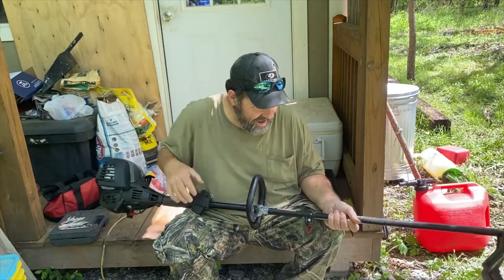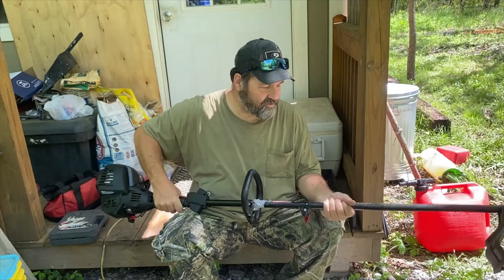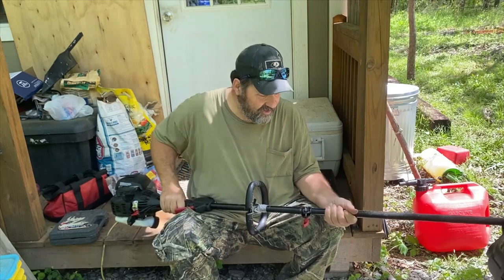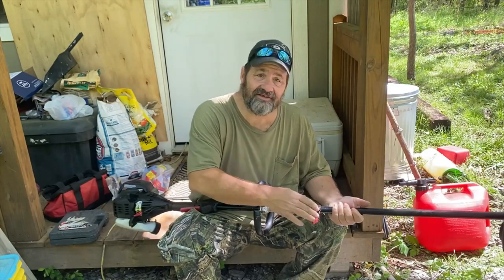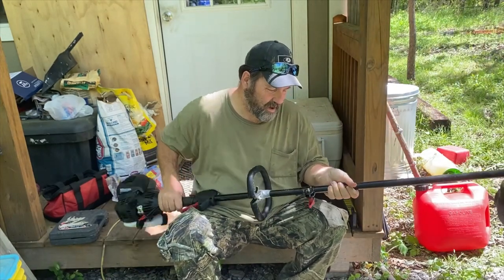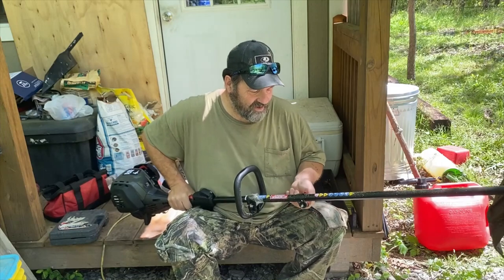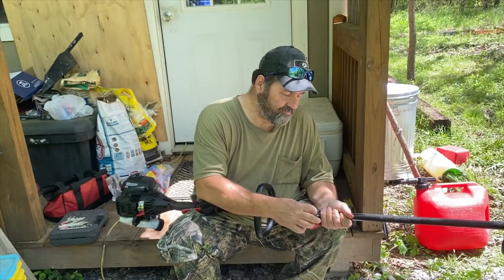And also, the torque. What I think is happening, you see this little tab, button right here, keeps it from turning, or is supposed to. But I think when I'm hitting it, it's jarring it enough to get up under here, and then the torque twists my shaft. That's irritating, and I have to come back and find that button again. There's kind of a lot of play in there, I think. I've tightened this up as tight as I dare to. This is plastic, and it looks like a quarter inch bolt, but I say that, and then here I go tightening it some more. I just didn't want to snap this piece of plastic off or strip the threads out. I imagine eventually I'll have to put another bolt and thread on there.